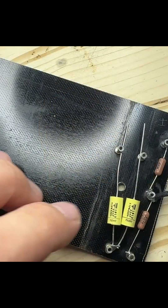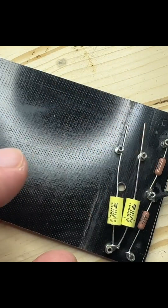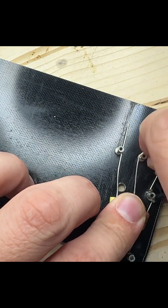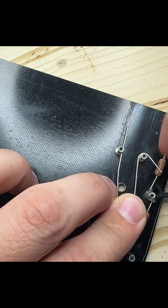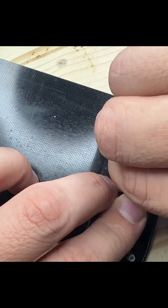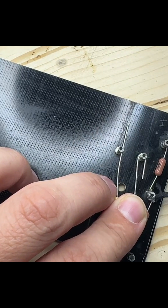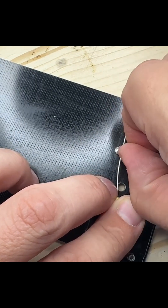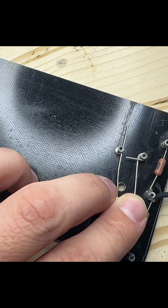So I'm going to show you that on the board. We have two capacitors here and the two turrets. So what they mean is at least 180 degrees — wrapping this around. At least 180 degrees and cannot have overlap. So basically right about 270 degrees right there.